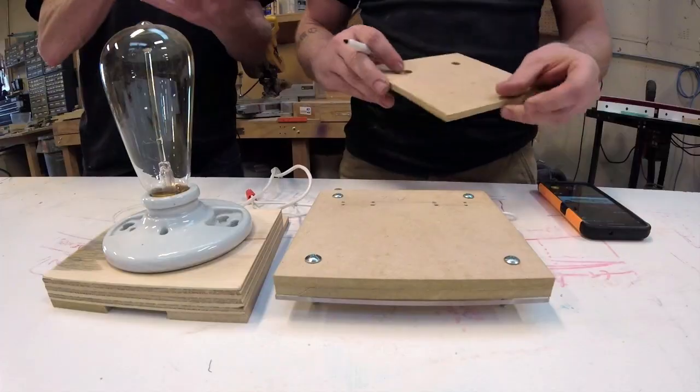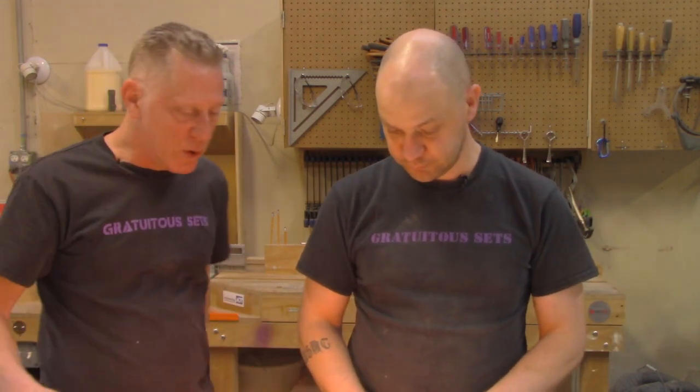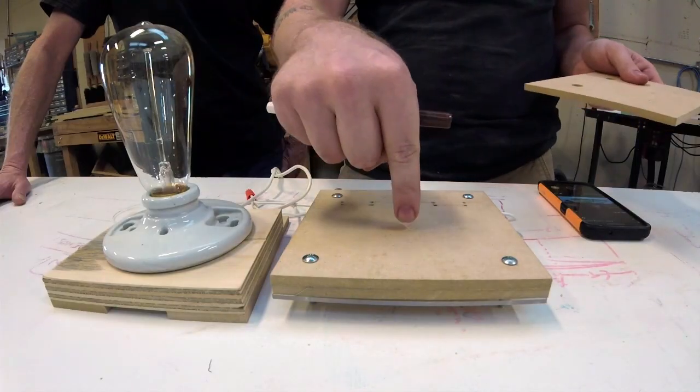There's a positive click when you place the element in place. Would that in some circumstances give someone a clue that would help them solve a puzzle too easily? The remedy: make it heavy. If you add some weight to it, you have a more massive object that one little magnet isn't putting as much noticeable force on. For the version we're going to show you, you have different pieces that have to go in different places and they're interchangeable so you don't know which one's right. There is a magnet in the center that we're doing a pull on, so even if you're in the wrong place, you still get that pull. The piece will snap into place regardless of whether or not you've solved that element of the puzzle correctly — so that provides you no clue whatsoever.